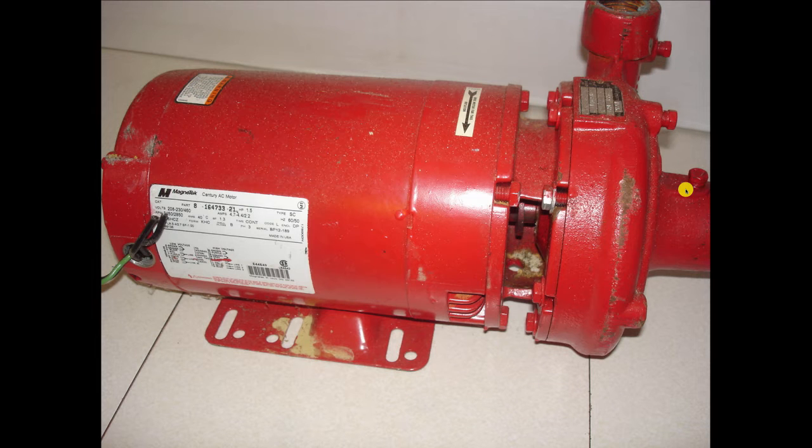But this was in a mechanical room. So follow the sequence of this. He thinks I'm very smart. So I go in there. I shut off the power to the circulator. I turn off the valves to the circulator. I open this port. I put a gauge in there. Another gauge in there. I open the valves and I start the circulator, and it gives me a reading. And I get the differential pressure across the pump, and I take that to a pump curve.